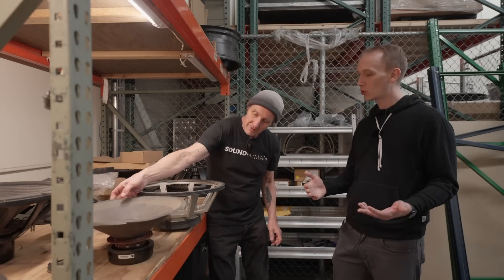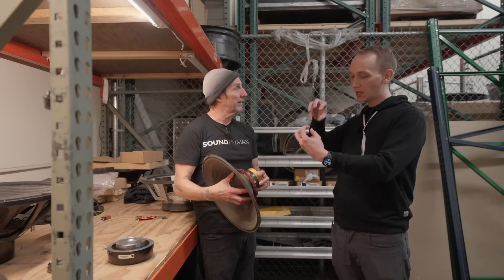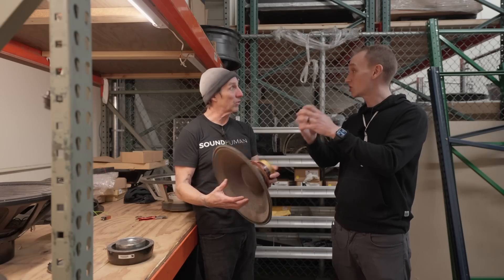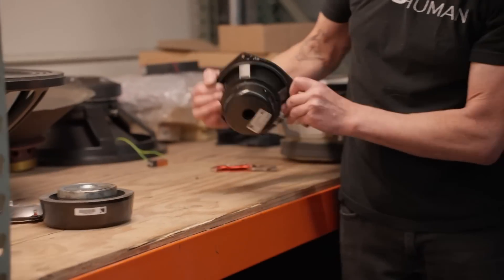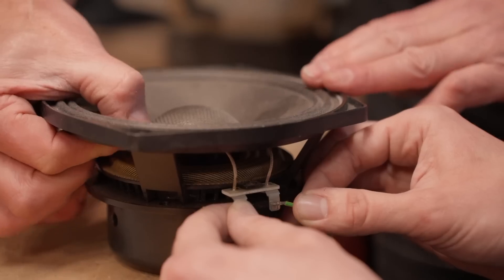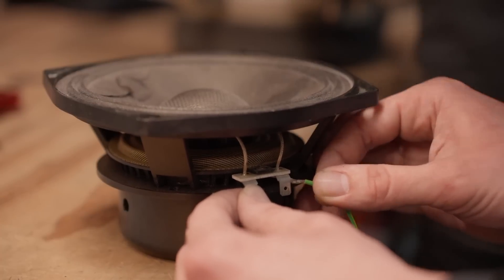So it's like a moving coil microphone in reverse. If you have a moving coil microphone, there's a coil of wire around a magnet. And when you cause motion to the coil of wire in relation to that magnet, you'll create an electrical current. This is exactly correct, and the reverse happens — it's reciprocal. So here's a speaker, and this will generate electricity when we move it. See how it's making — you can feel the energy — so it's creating electricity, and we're shorting it out, and we're hearing kind of the noise remnants of that happening.